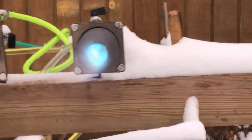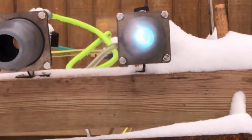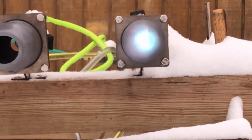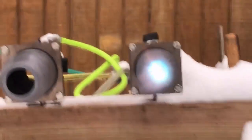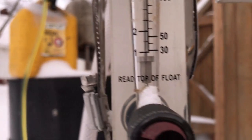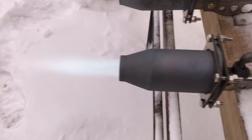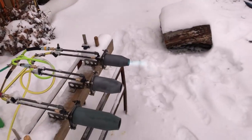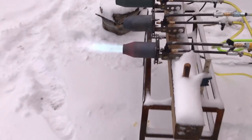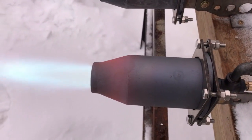This isn't putting off that really large flame — it's a very efficient combustor. Look how white hot that gets inside of there. The amount of hot air blasting off this thing is incredible. This is about 100 milliliters a minute, about 60 kilowatts. We're not even getting a register on the scale yet, but this thing is kicking off a lot of power. You could definitely heat up the firebox the size we've seen on your plant to 900 degrees very easily at this setting.